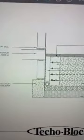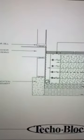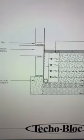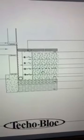And to be extra safe down here where there is the potential for moisture to accumulate, we have a pipe. And that pipe is just plumbed to drain water out. So any moisture that could accumulate in this area hits that pipe and flows out. And over here, we see our wall, we see our open graded stone as the fill.